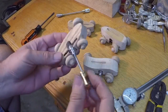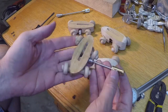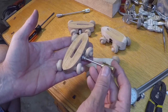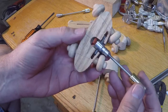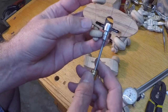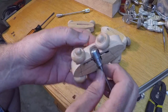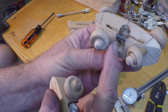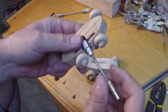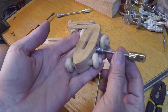I worked out a design for attaching the drive arms to the car. I needed the car to sit flat and be able to adjust itself depending on where the yoke ends up — the yoke's not perfectly true so it's going to move around a little bit. What I arrived at is this sort of hinge design with a knuckle cut out of aluminum. I used Forstner bits to hog out the wood, then a Dremel to cut a little slot, with the nail nice and tight in there. The aluminum knuckle goes over the nail and allows the car to pivot relative to the drive arm.